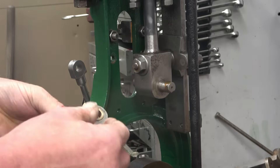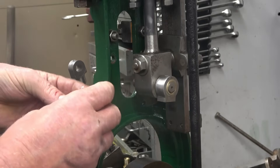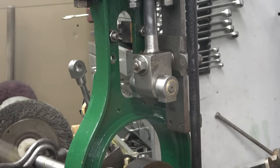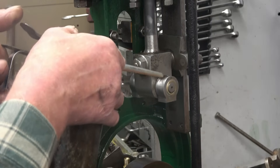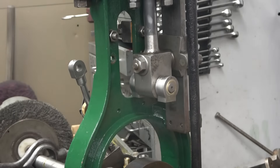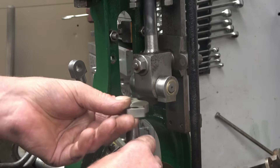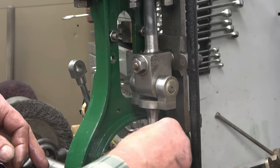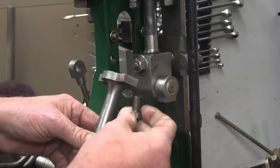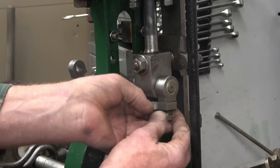These are numbered — that's number one and obviously that's number two. A drop of lubricating oil in there is all it takes. The connecting rod is also number one and two so that goes on there that way. I'm going to bolt that on next — it's got two nice BSF bolts coming through there.